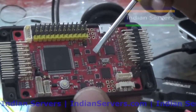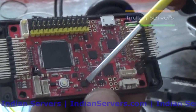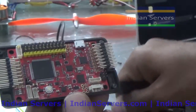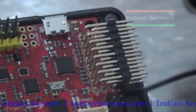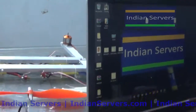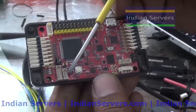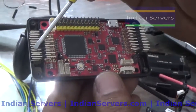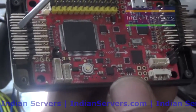The gyro and accelerometer are responsible for maintaining the stability of the quadcopter. This is the onboard magnetometer. If you want to use an external compass or magnetometer, you have to use a jumper here. If you place the jumper, you can use your external GPS or compass. This is the external GPS and compass connector - how to connect GPS here and compass via the I2C bus.